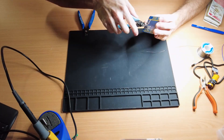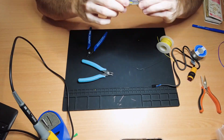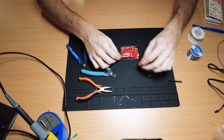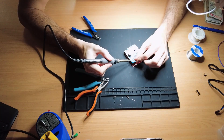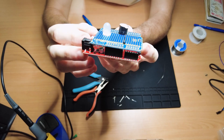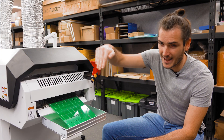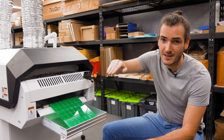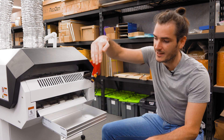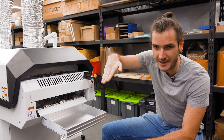The sensor gets its own three pin header. I already tested the sensor at various heights and angles over the output tray so I was confident it's suitable for this project. The only thing you really have to look out for is direct reflectance from the tray, so it's best to mount the sensor at some angle.